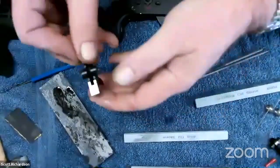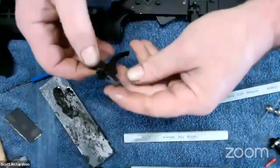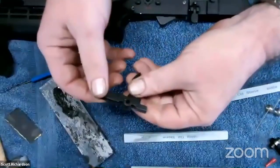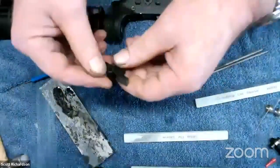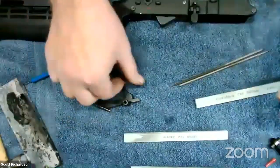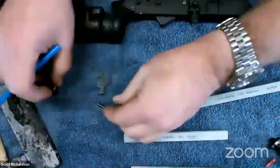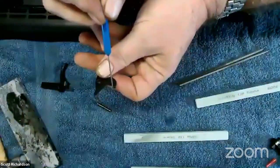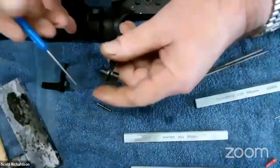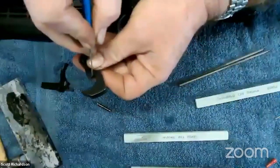Normally on a bigger surface I'd work in circles, but on this piece I do what I can. Flitz will really polish it even finer. It's a lot smoother than it was but not as smooth as I'd like, so I'll probably finish this offline and send it to whoever I'm instructed to send it to. I want to clarify the surfaces we're dealing with: the top of the disconnector hook, the hammer notch, and that little edge — those are the surfaces to smooth out.